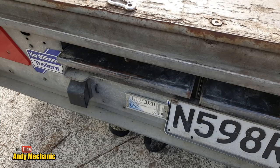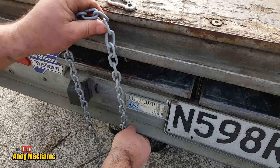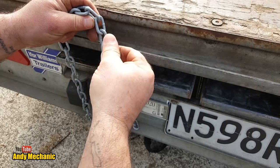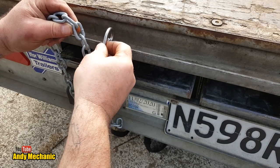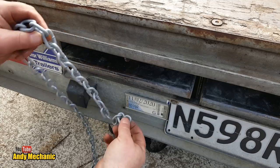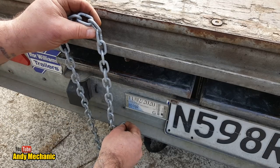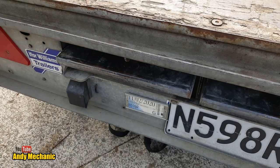I'm thinking something along the lines of a chain down the midpoint for each ramp, so we'll need two bits of chain. We're going to bolt that down onto this flange here, and then the chain will run up like this. It doesn't need to be tight, because the ramp can move out a little bit and it'll just catch on the chain. We'll split one of these links, bend it open, drop the clip in, close it up, put a spot of weld on there. Then we'll drill a hole in this bit and the clip will just drop in like that — easy to take on and off. That's the plan. The first thing to do is work out where the centreline is, drill a hole, bolt that bit of chain on temporarily, and work out how long the chain needs to be — I don't want it stupid slack, but I don't want it too short either.